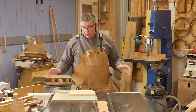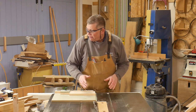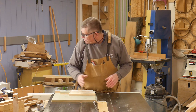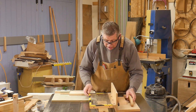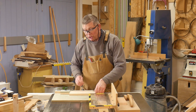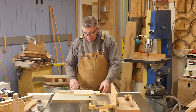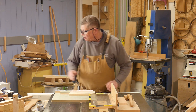You'll notice I've got no guard on this. The super guard I usually have is normally supported by my fence, and although I have a bracket support for it, it makes it difficult for you to see, so I'd rather not use it for this. Instead — because I never use my saw unguarded — I've got a standalone guard like this, which means I'm going to touch that before I get anywhere near the blade, and it also stops anything flying up off the top. So I think we're just about ready: stop is set, work piece is right, guarded, blade set at the right angle.